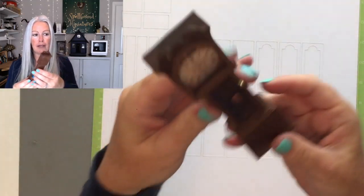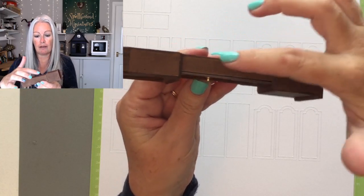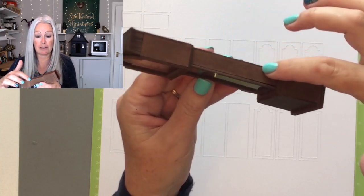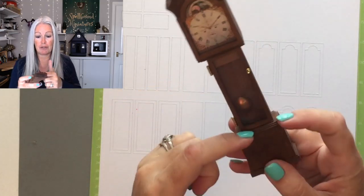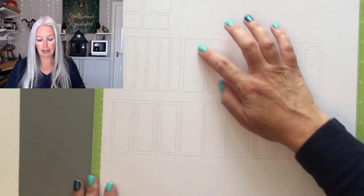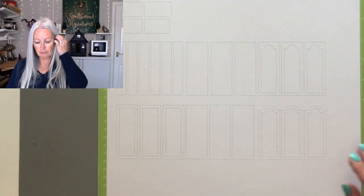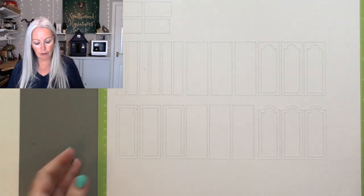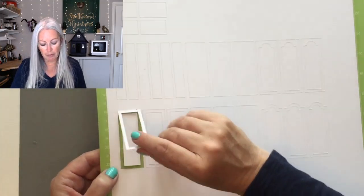The back is just slightly longer than the door. If the door and the back were the same height, the door would scrape on the bottom. The back piece is slightly longer and the same length as the sides; the door is slightly shorter so that it can open and shut without scraping. So the shorter ones are the doors and the slightly longer ones are the back. You're completely flexible about how you'd like to make your doors, and you don't have to have them opening.